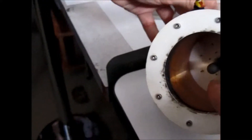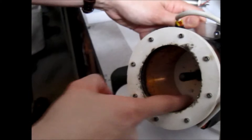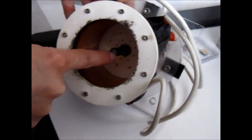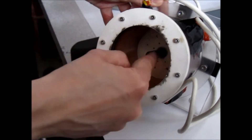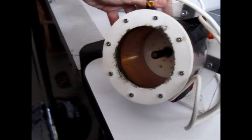So what does this part of the center do? We're injecting the gas from those orifices there. This is a cathode and it emits electrons. By collision of these electrons with the neutral gas, you're ionizing it and creating a lot of charged particles — positively charged.